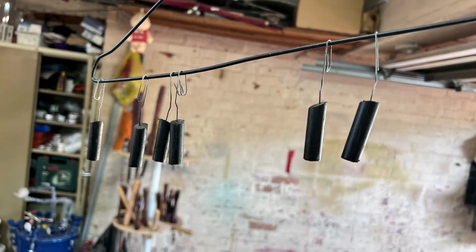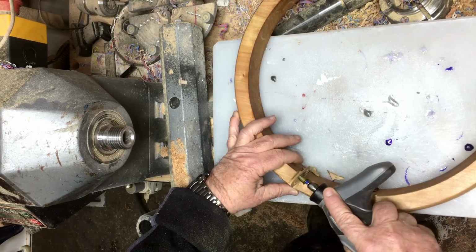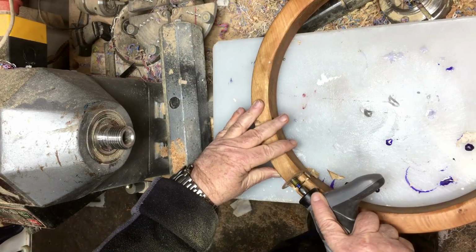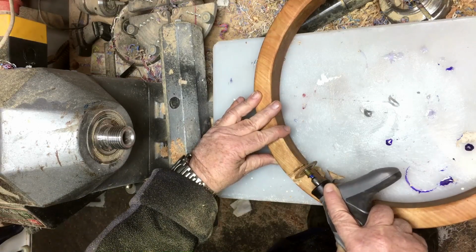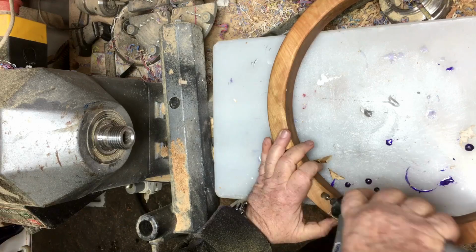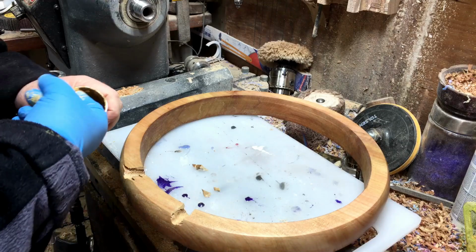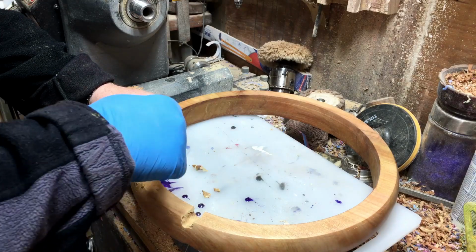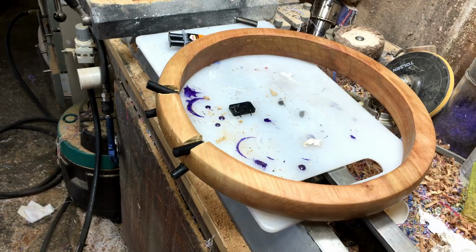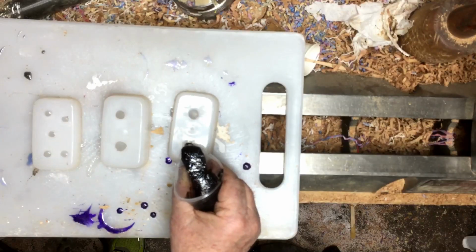Inside this rim there were a lot of holes that I closed, and those I just sprayed black, for the legs. And what happened here was that I drilled the holes. I drilled a pilot hole, and then I drilled a hole, and somewhere it cracked, and I decided to make it a feature instead of throwing the whole thing away and getting another idea. So I'm adding a little bit of wood sealer, wood repair, and that will solve the problem. Not super glue, I used epoxy glue.